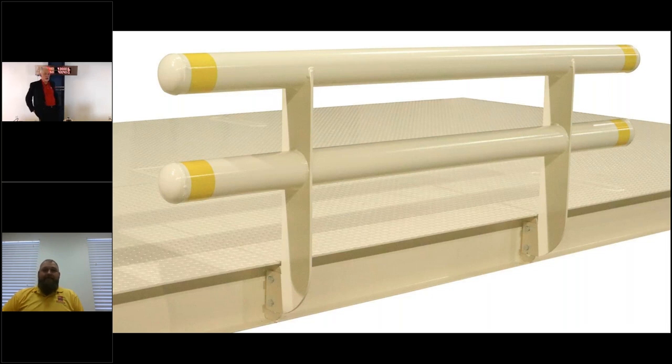You were mentioning earlier, I believe on the last session, that when we ship the Armor portable truck scale, we're normally within two divisions. And in Texas then, generally, you really don't, and once you put the weights on it, if the scale is within tolerance, you don't really need to go through the process of calibration or anything. Is that correct?